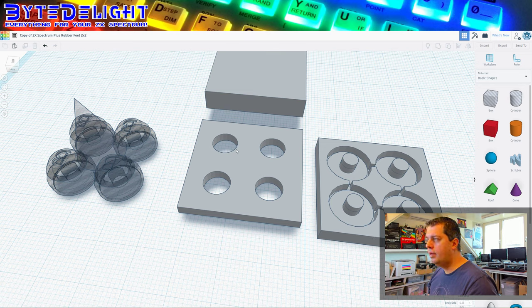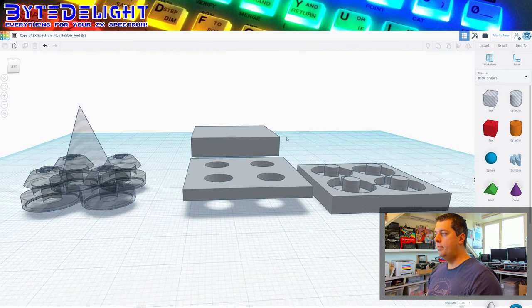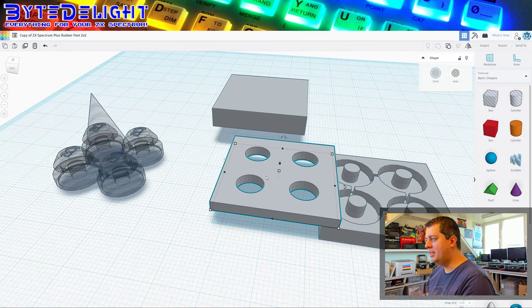I think this will do — yes it will. We're going to make these holes and merge it, then the holes will be done. This is the neck part. Let's group these again. So when I put these parts together, the material will go from the top through the neck to the bottom, and once it solidifies you can remove the bottom, then the top, and cut away the excess material. Then just push the rubber feet through the holes — that shouldn't be a problem because it should be flexible, the same as in the ZX Spectrum case.